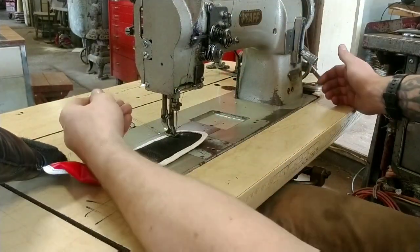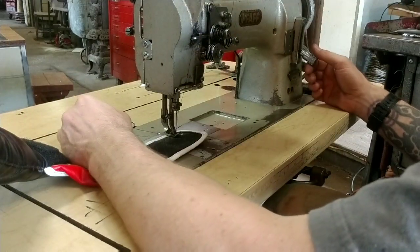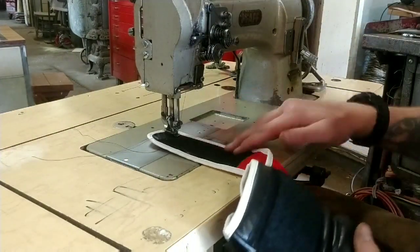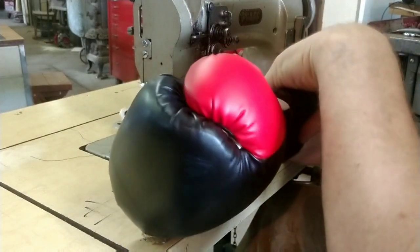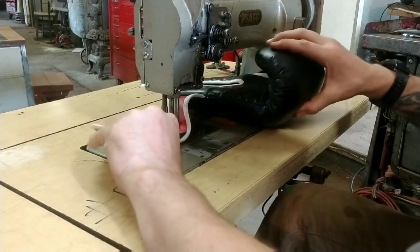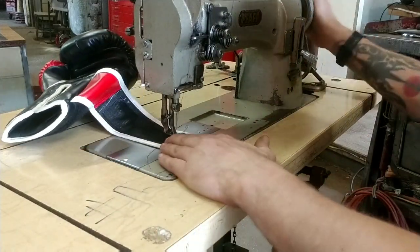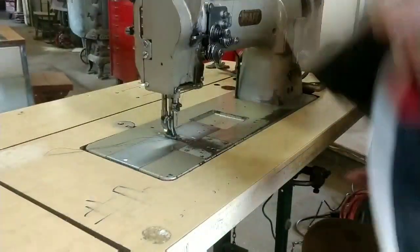Here you can see I'm just fixing some Velcro on these boxing gloves — sewing new Velcro on — and you can see back tacks wonderfully. The machine has needle feed, so this kind of job with the Velcro it just cruises right through, because where my 1591 won't feed the Velcro — it just slips on it — this machine the needle pierces the work and then feeds it, so it works great. Thanks for watching guys — we'll see you next time.